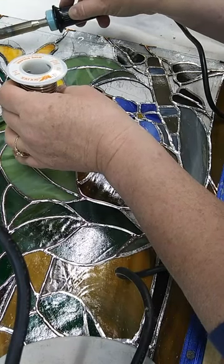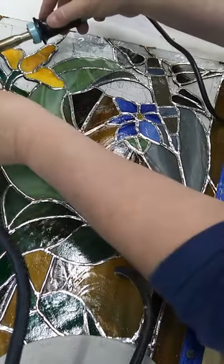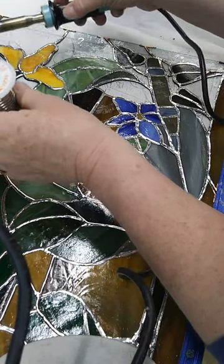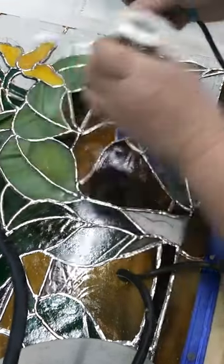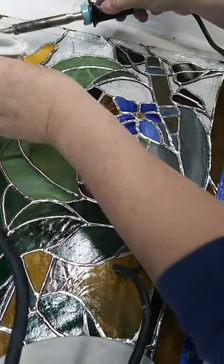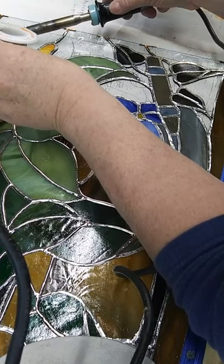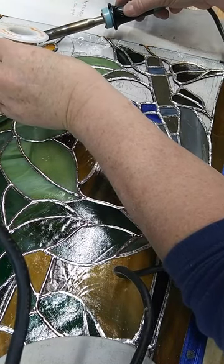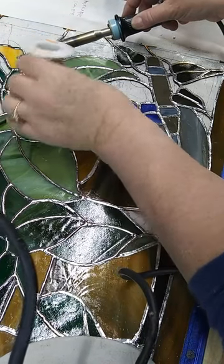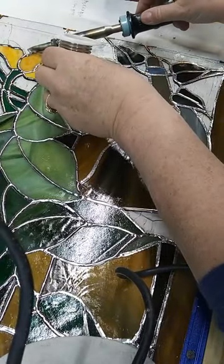If you have to go back and touch up, make sure you're not just going on the surface as you remelt, that you're melting it all the way through. Because that's also what makes those sharp little barbs or layers that peel off as you're cleaning it. Tink! Thanks for falling on a seam.